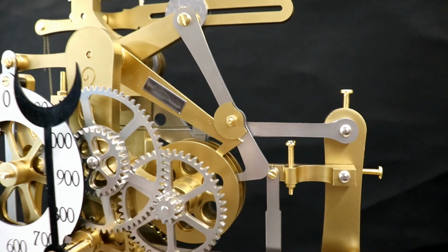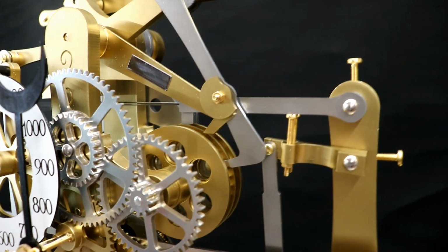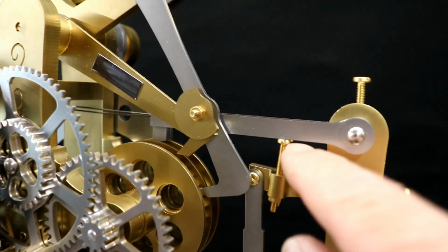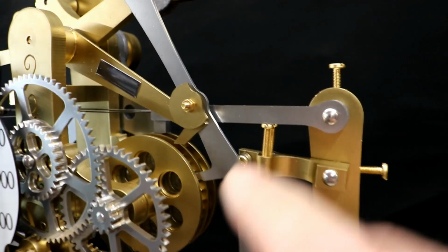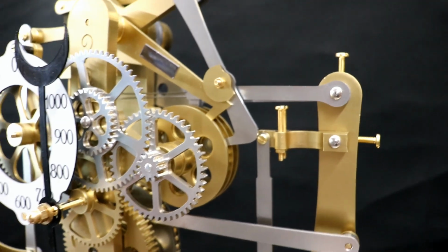It's a bit later and everything's going swimmingly. And I'm so pleased that I've added so many little adjustment things, because now it's all working. I even discovered that this mechanism wasn't lifting these ratchets, these front two, enough, because the weight of these back two was lifting those too high. So I've lowered those, twiddled and fiddled about with them. Now it's perfect. There's enough force for that to work properly. There's loads of little things like that.